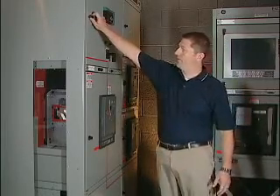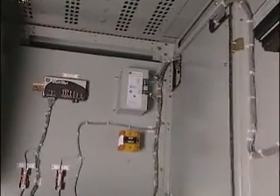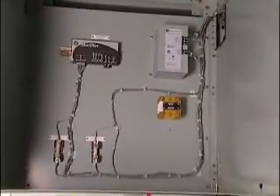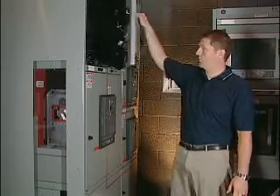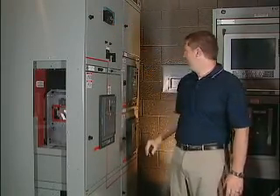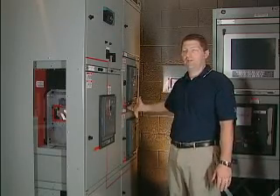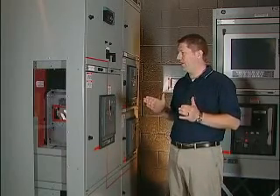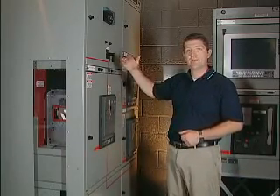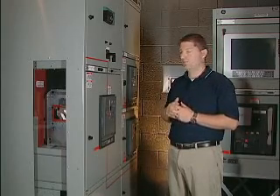We have also designed it with heavy gauge steel — 13 gauge, 14 gauge steel. We've designed an extra deep control compartment so that you can put rack-mounted devices and other items into this toward the spec. We have 85 and 100kA feeders, four high for all of our feeder circuits, and it's a 22-inch wide section, so it's extra narrow. We have stackable mains, main-tie-main configurations, and most of the configurations available in AKD 10 that you may be familiar with.